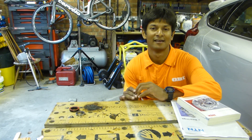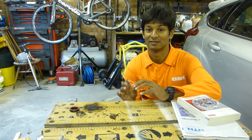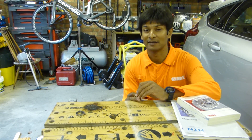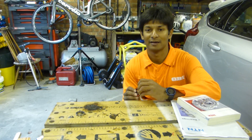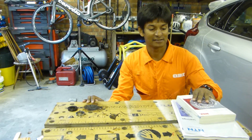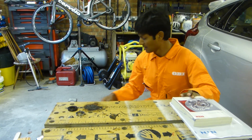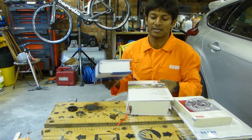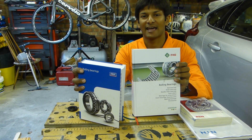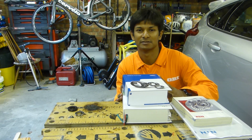The first three — JIS, ISO, and DIN — are basically interchangeable. The only difference in those bearings is the actual number they are given; the dimensional size is the same. ABEC, which has proliferated from the skateboard industry, is used by Enduro — they're the only ones who really use that. NSK and NTN, anyone who's Japanese, uses JIS numbering. SKF, INA, and FAG — part of the Schaeffler Group — use ISO or DIN numbering.